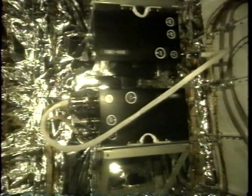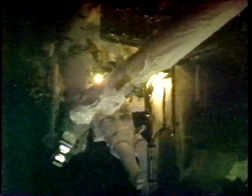And those are the first two bays that they will attach what's called NOBL by its acronym, N-O-B-L, for New Outer Blanket Layer, which is a semi-hard shell layer that matches the same size as the door of the work site. This new insulation blanket will be installed almost directly over the old insulation blanket, which has shown the effects of 9.5 years in space in the harsh space environment, with some of the insulation tearing and peeling. And so these new outer blanket layers will be installed first on bays 9 and 10, and then the flight control team will assess the amount of time remaining to see whether or not there's enough time to do two more bays, which would be 5 and 6.